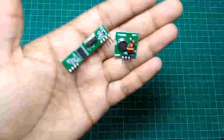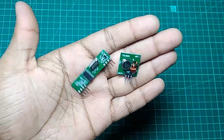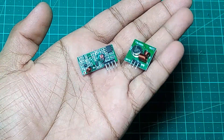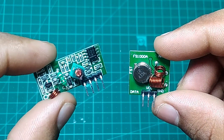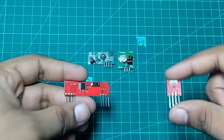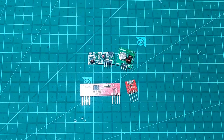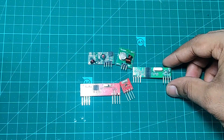As you can see, I bought this 433 MHz RF module and they work just fine. The best part about them is they are very cheap, and since they use ASK modulation they are pretty straightforward to use. Most importantly, different models of the transmitter can communicate with different models of the receiver.